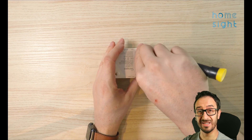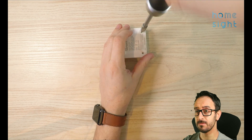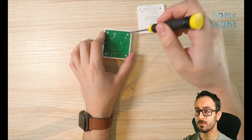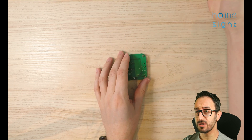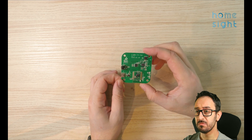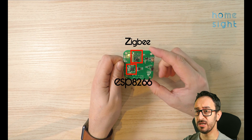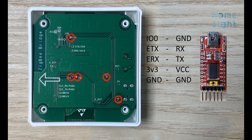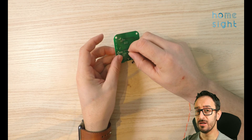I'm going to start taking this thing apart and get these four screws out from underneath the little rubber feet. Here you can see we've got the ESP8266 chip down here and the Zigbee chip up at the top. To connect it for flashing I'm going to use a TTL to USB adapter. There are two ground connections — importantly, you need a ground on IO0 as well, which prevents it from booting into its normal boot mode. On my TTL adapter I've soldered an extra ground connector.